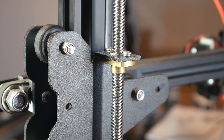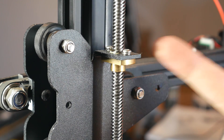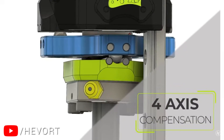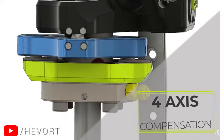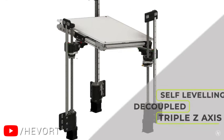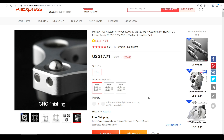Typically, the connection between the lead screw nut and the printer's gantry is solid, with the two directly being bolted together. But as shown in this snappy animation, Wobble X goes in between the two and allows a lot of freedom of movement. This includes both slide and tilt in two different directions, which should eat up any misalignment and make sure that the rotation of the lead screw translates to vertical linear motion.